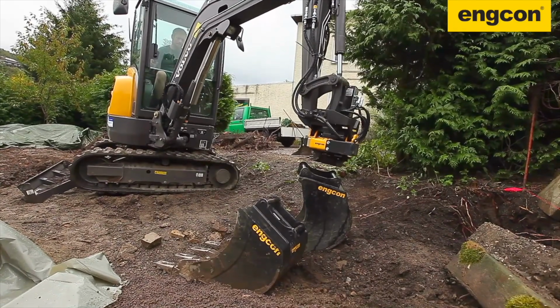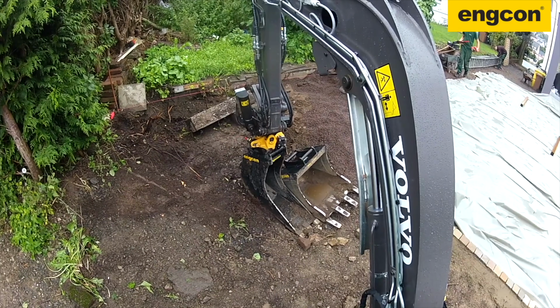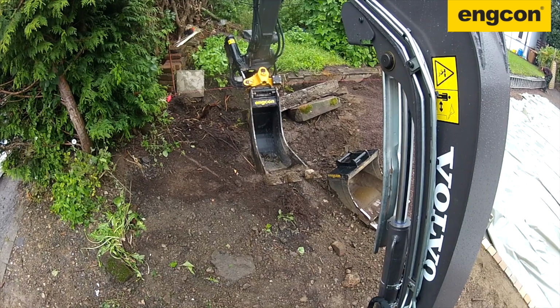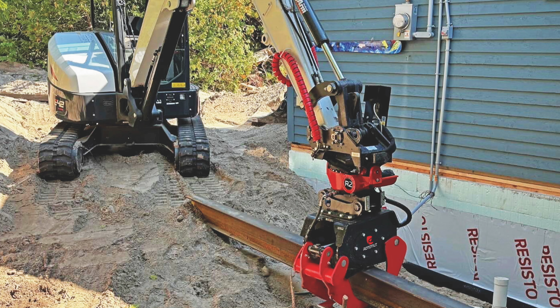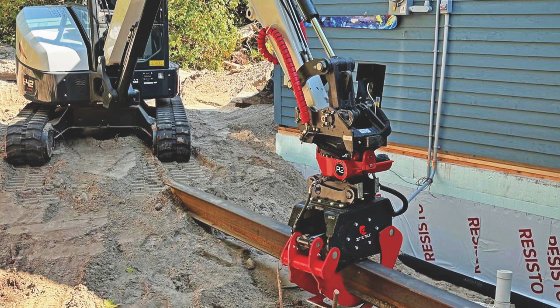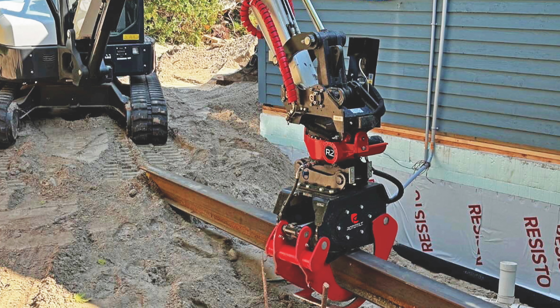So the first thing to establish as we get into this conversation of the ease of connecting tools is that tilt rotators don't make connecting to other tools or other attachments more complicated. It's an attachment for your attachments, right? But that's as deep as the complication gets. In general, you can equip tilt rotators to swap between tools in under a minute, and that includes hydraulically powered tools, and without having to exit the cab. And that's key to the versatility angle of this, because what we're going to dig into here is replacing labor or whole machines with whole other attachments.